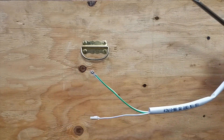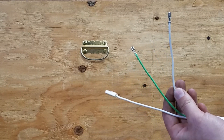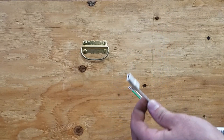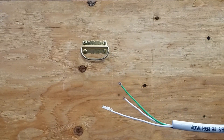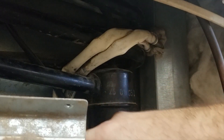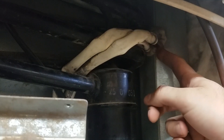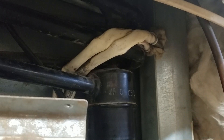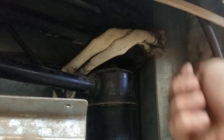You will see here, following the two whites and the light green, they lead up to the 110 volt heating element — that's what we are going to be changing out today. Looking at the new part, we are going to have three wires: green is going to be ground, the white wire is for the thermostat, and the other will be the lead from the switch. Following the wires down, the two whites and the green indicate the 110 volt burner, which is this front one. This tube starts here and comes all the way down into the flue, so you'll need to fish that all the way out and replace it with the new one.